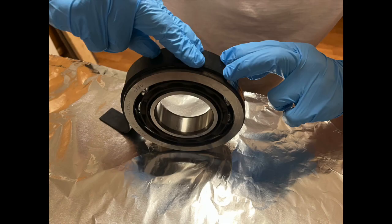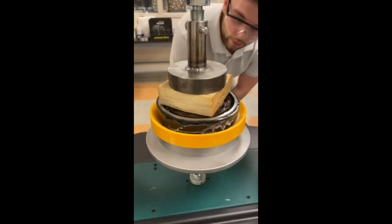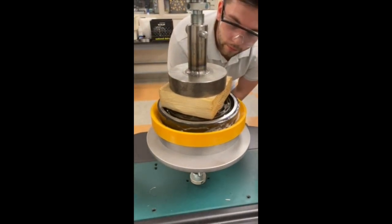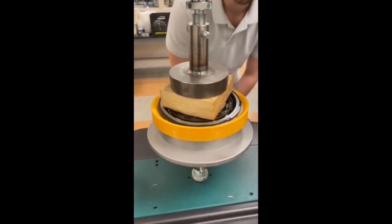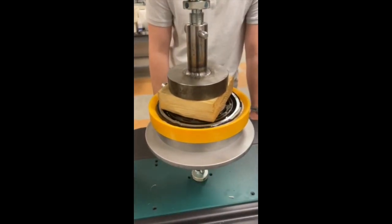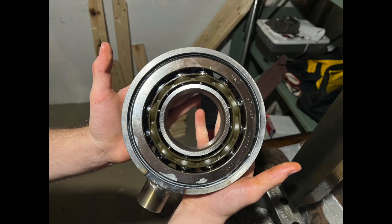After identifying the best lubricant and adhesive, we installed the rubber liner using the press fit method, which involved our designed small scale housing and an arbor press. Our chosen lubricant was a Dixon P80 and our chosen adhesive was a Loctite 495 adhesive. Once the small-scale bearings were assembled, we proceeded to the post-assembly testing phase.